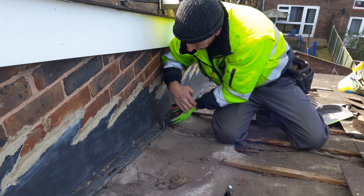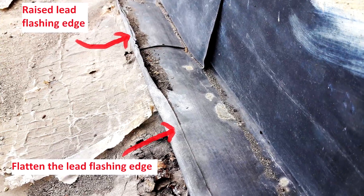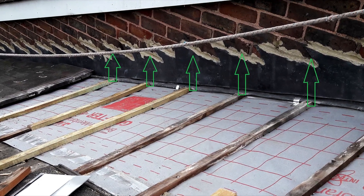In this case I will remove the roof leak by folding the lead edge 90 degrees to create a barrier. And for the roof tiles not to press the lead edge again, I will raise the roof batons up about one and a half centimeters.